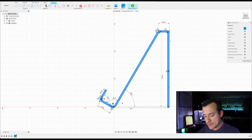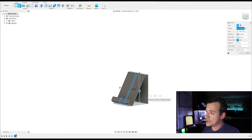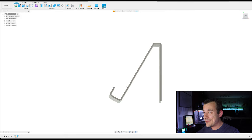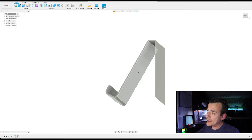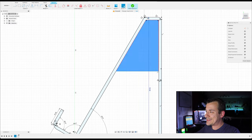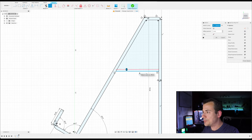I'll select this inner region and press E to extrude. I'll change it to a symmetric extrusion and tell it 30 millimeters, so it'll wind up being 60 millimeters wide. Now we've got a 3D shape we could print right now. But if I put something heavy on it like a tablet, these thin pieces will probably bow outwards under the weight. So I'll add a cross beam from the back to the front to make it stronger. I'll open up the sketch, create a line going from back to front, then press O to offset it — 1.6 millimeters. A good rule of thumb is to make wall widths a multiple of your nozzle diameter; mine is 0.4 mm, so 1.6 mm is a good multiple for strong walls.